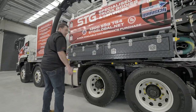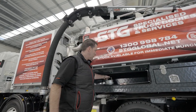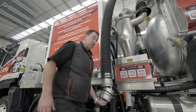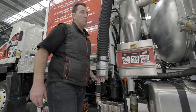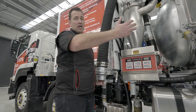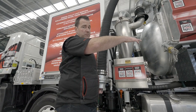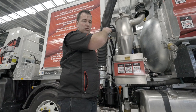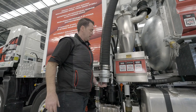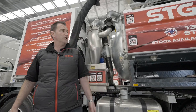After the initial dewater you may have used 2000 liters for the day but only had 200 to 300 liters come out, so there's still more water in the tank. Walk around to the side — at this stage the blower would be running at low revs. Get your end cap and place it over the six-inch outlet; that creates vacuum which starts pulling the mud off the back door, creating a cavity for water to flow out. You'll actually hear it — it'll be very audible as it chugs the mud back from the door and the water flows out. Once you can hear air coming through, remove the cap and the water will begin flowing out again.